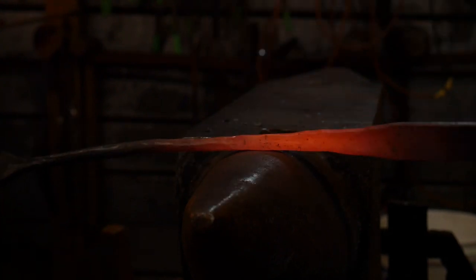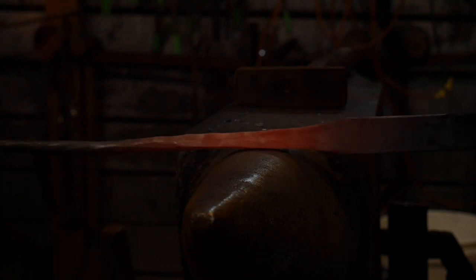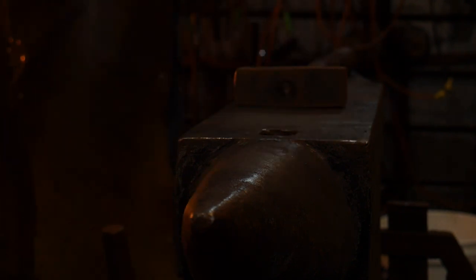Using both these techniques effectively will help you draw material to the same thickness. Feeding into the dies looks like this — you are feeding the material into the dies and evening up the surface planes. When you are drawing, pulling back towards yourself as you hammer, or out to the end, you are drawing out, stretching, or elongating the material.